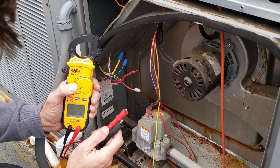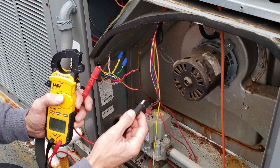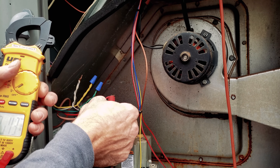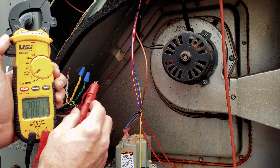I'm going to do one more test with the multimeter. If you don't have power to this package unit or to the transformer, you're not going to have 24 volts to even signal for heat to turn on. I'm going to measure between the hot and the common — we do have power, 28 volts. Now we're going to move on to problem number three.